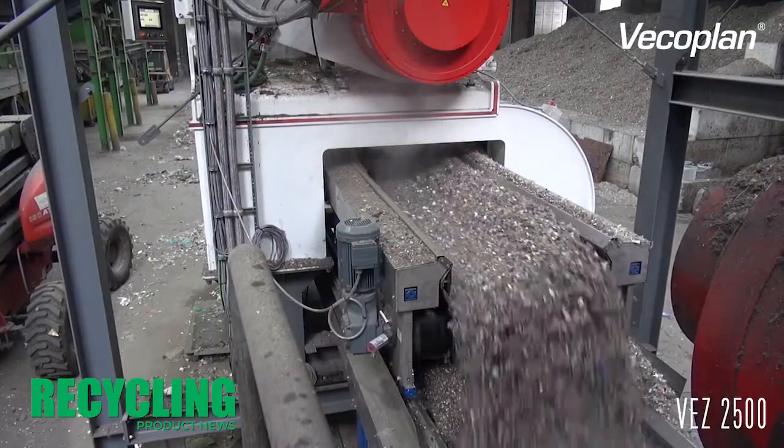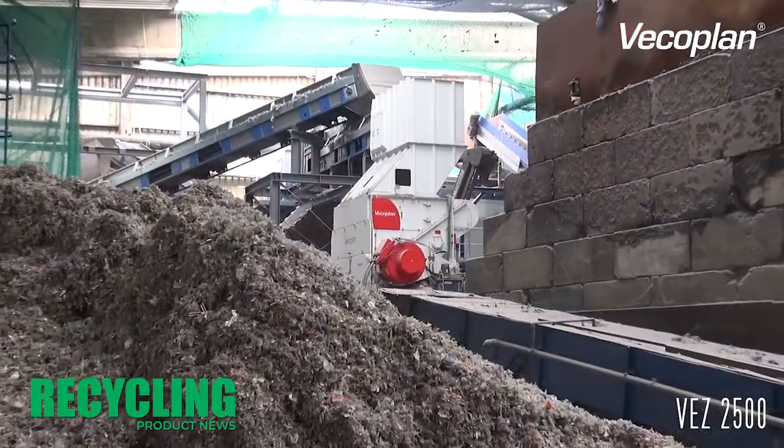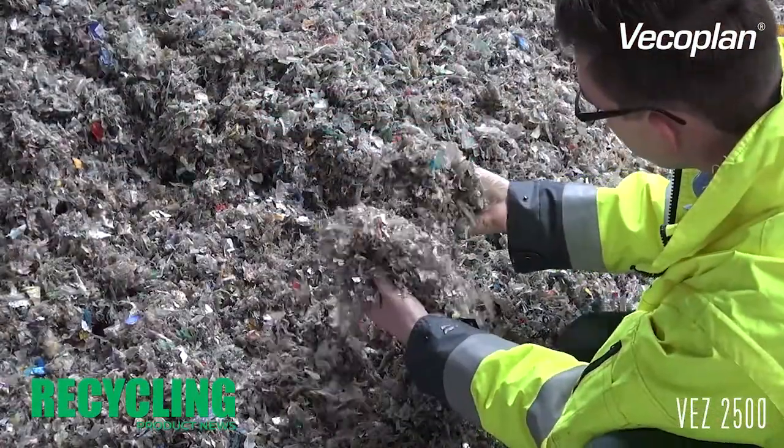Anything else about the VEZ2500 that should be mentioned? There are several shredder manufacturers out there that build a very similar shredder. The main difference is the way we drive the system — the high-torque motor is an electromagnetic drive that will produce over 25,000 foot-pounds of torque, which is the most in the industry. We have another level up from that that will produce 40,000 foot-pounds of torque with two motors, again the most in the industry. It's also the most efficient, saving roughly 50% in energy costs compared to its induction motor counterpart. That's really where we change in philosophy, coming from our German counterparts where energy costs are high. It's not a horsepower race — it's a torque race. We really push torque and efficiency, and that's where we try to separate ourselves from the competition.